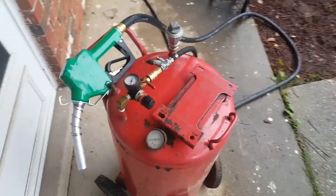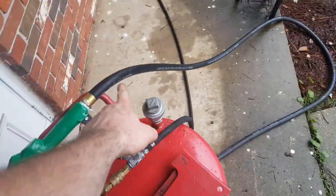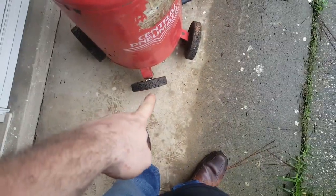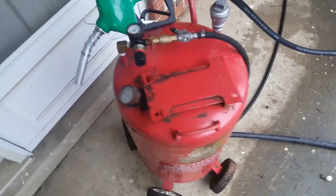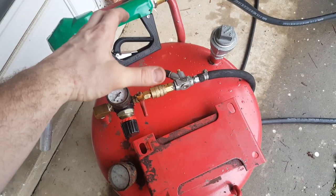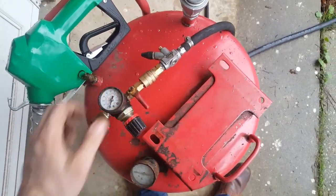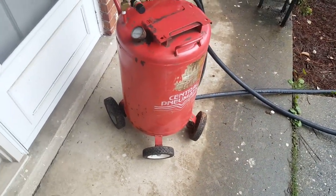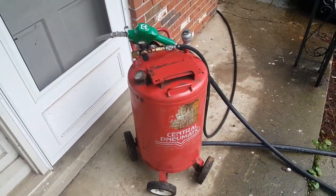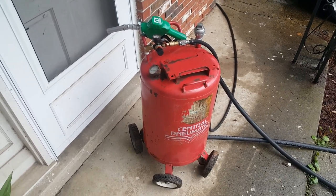There are probably a couple things I do need to observe when using this system, and that's that it's not actually grounded. The handle is grounded to the body through a hose which has a conductive wire — actually just a spring — wrapped around the inside of it. The body itself sits on top of plastic wheels and is connected via a rubber hose to the compressor, so it's not truly grounded. Before I make the compressor fitting connection, I have to grab the chassis first to discharge any spark, like I do on all the computers I service. That way I don't blow myself up. You've also got to keep a fire extinguisher around — I do have one, but it's a little out of reach. Since we're just pumping water right now we don't really need it. We'll put fuel in this thing later and give it a test.